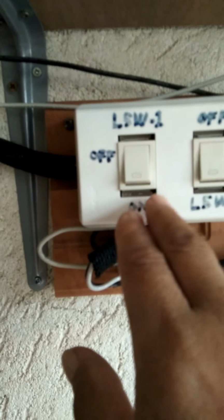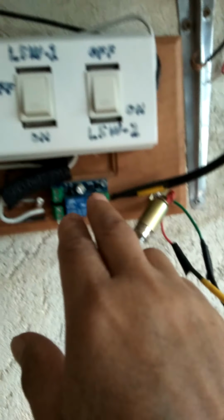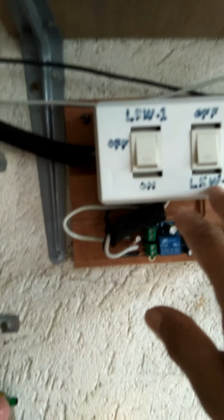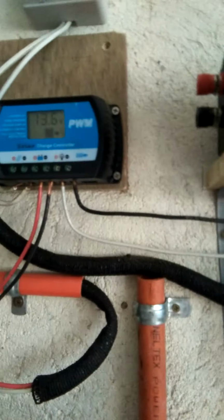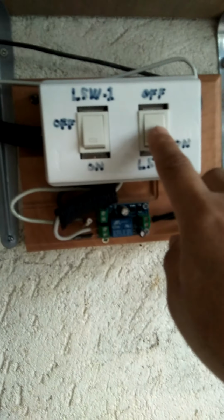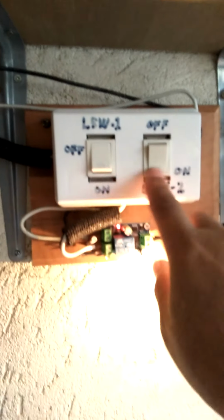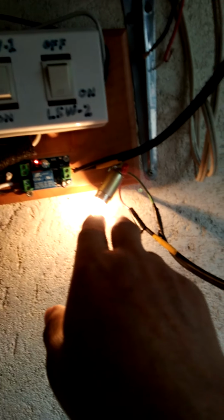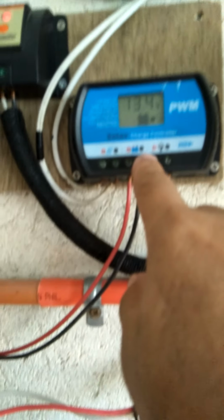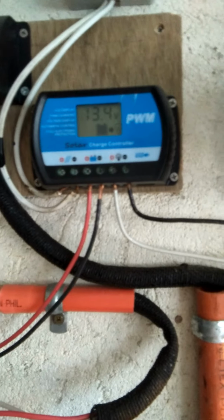Right now the load switch 1 and load switch 2 are open, but now I have to close the load switch number 2 for this charge controller number 2, which controls the flow of the supercapacitor number 2. So right now I'm going to close the load switch number 2 to demonstrate the principle. It's closed already, and it energized the load immediately from the remnant energy of the supercapacitor number 2, and it shows here 13.4 volts. It's diminishing now because there's a load already,